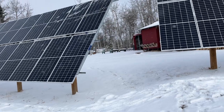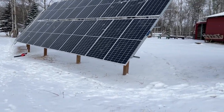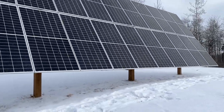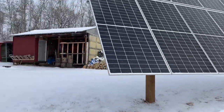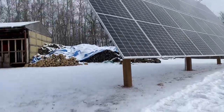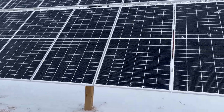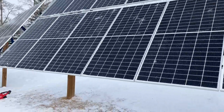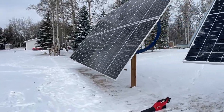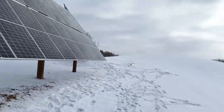There's ice formation on the surface because the drainage is too slow. We had pretty good sun yesterday — I think I was pulling 15 kilowatts for a spell. These ones don't have any surface ice on them, only the 50-degree one does. That five-degree change made quite a difference. The critical factor of making sure you don't have any snow on it is huge. People who say 'oh don't worry, the sun will take care of it, melt it off' — no, they're wrong, pure and simple.